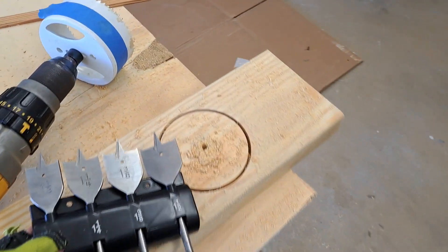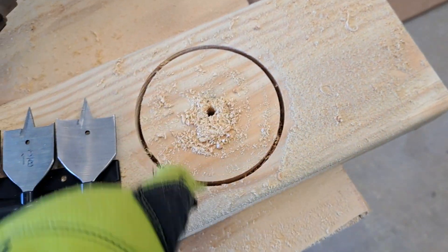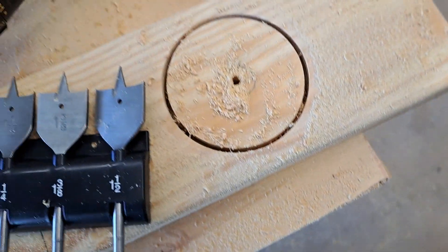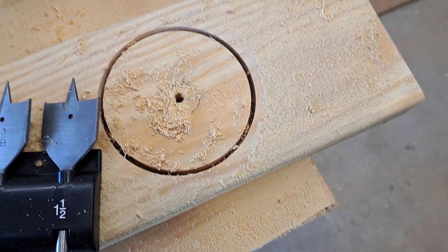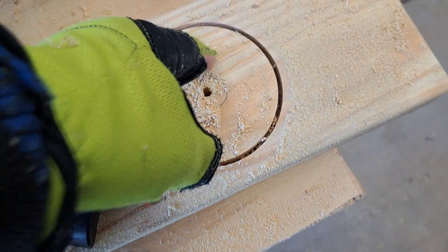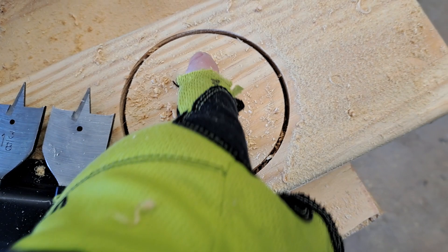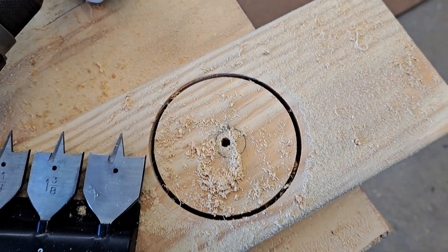I wanted to do the ring first because I didn't want to have to do these cuts and then try to get close to my line. So I figured I'd do the ring, get the outline done. All I have to do now is take the material away. I want to drill the material out — that's the only way I can think of doing it without a hammer and chisel, which would be silly. So I'm going to use these bits sequentially and tape off the depth just like I did on my hole, and do it until we get everything cleared. I may have to clean up the bottom with a chisel, but we'll see when we get there.